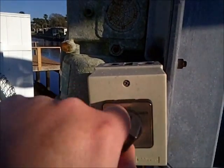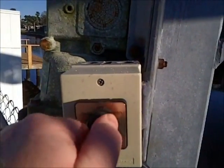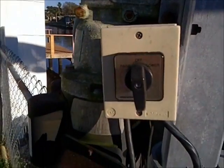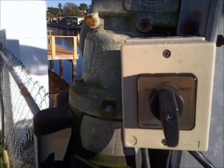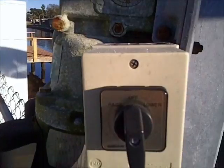But this will raise the boat, and you can hear it raising the boat. You stop, the other way it'll lower it, and if you switch it from raise to lower real quick, it'll keep going the same direction, because it's not slowing down enough for the starter to reset. So inside, I'll start to diagnose some of this Salzer switch.